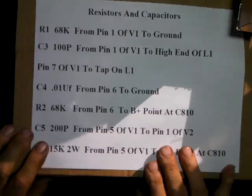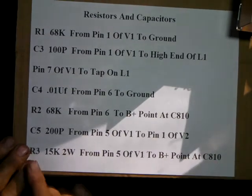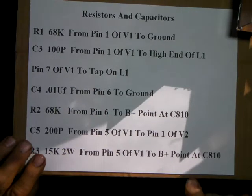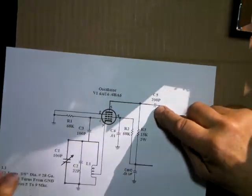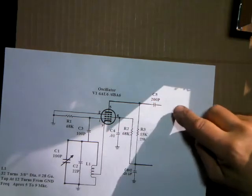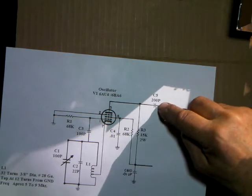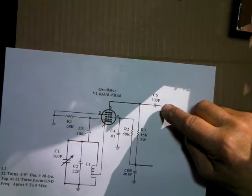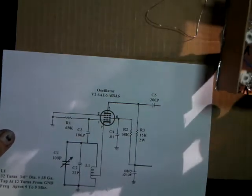So I'm going to go, boy, that sun's giving me fits here. I'm going to take the cap from pin 5 of V1 and hook it to pin 1 of V2. And what that is, this capacitor, it just simply leads off the schematic, and we'll pick this up on the next video where I hook it to the multiplier buffer. Actually, it's just going to be a buffer amplifier on this application. And that's going to be another silver mica.